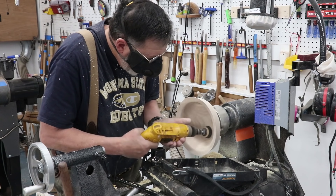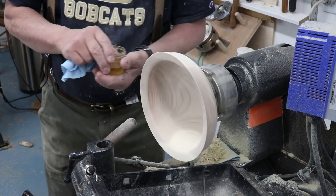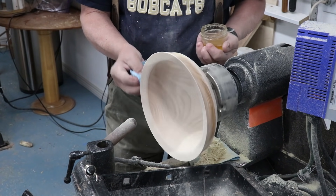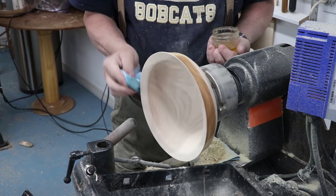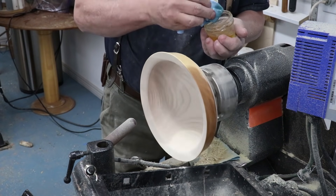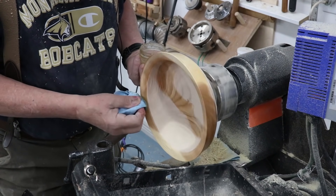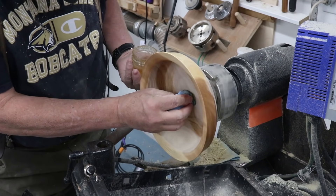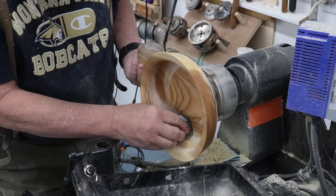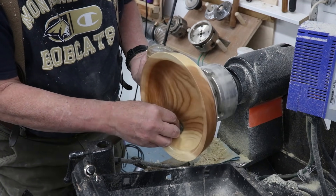If I'm on the outside, I'll turn the lathe in reverse and sand the outside. This video is all about the procedure for completing a rough turn bowl after it's dried. Part of my procedure is sanding the inside when the bowl is in this position — I can do a lot of work with the lathe spinning and sanding. Right now I'm going to apply a little finish. Depending on what I'm doing in my shop, I may apply two or three coats of an oil. In this case it's a salad bowl or food server, so I'm going to put a drying oil on there. In a second you'll see that grain just kind of explode — it's really, really pretty.